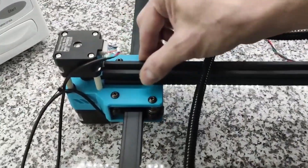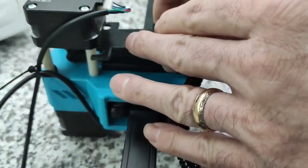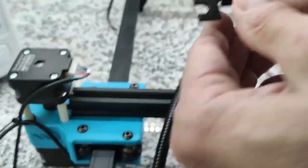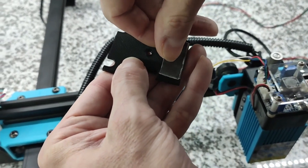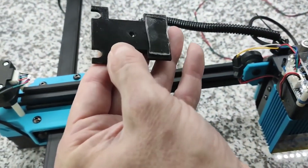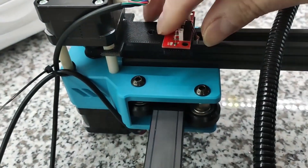On your laser engraver, we're going to start with this top rail right here. Take the 3D printed piece that has these two notches — they were designed to literally slide into the plastic pegs, preventing it from slipping. Take some double-sided sticky tape and put it just on the edge of this 3D printed part. Then peel it off, take your end stop, and stick it right on the edge of that. Once you have that on, simply slide it in and make sure it goes all the way over, and you're good to go.